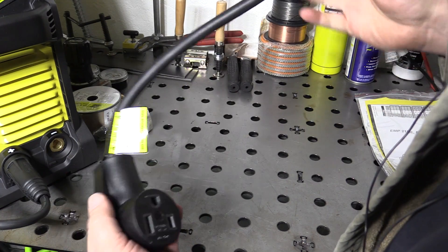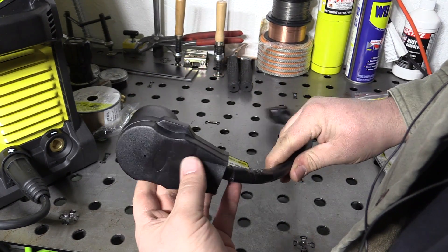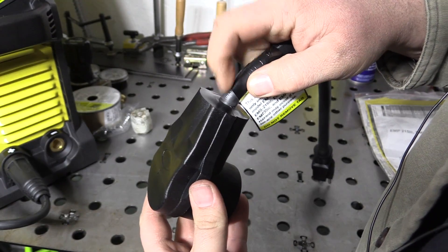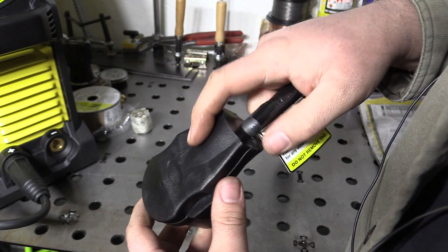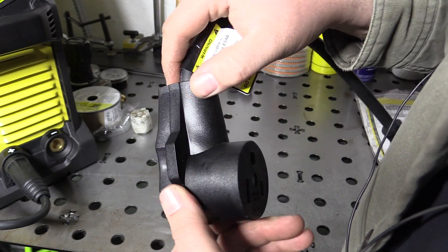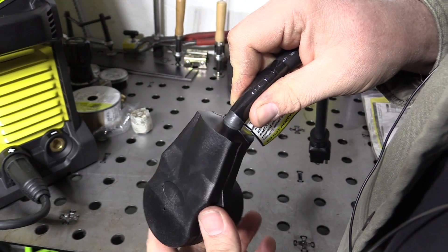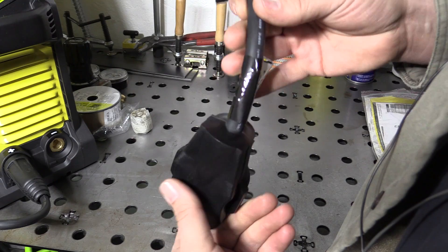This is a dual voltage machine and it does come with an adapter pigtail to go from 240 to 120 so you can plug it into a standard 120 socket. This seems like a pretty standard cable that a lot of machines come with. But one thing I do not like about it — it has a nice rubber molded head, which is pretty typical, but it is not attached solidly to the insulation of the cord itself. This just rotates freely on here — it's totally loose on the cable. So that could be letting the stress of the cord transfer into the connections inside without any kind of strain relief. This isn't something you can open up to inspect or repair. I kind of question the durability and longevity of this. It may be fine, but I wonder how it'll hold up long-term.